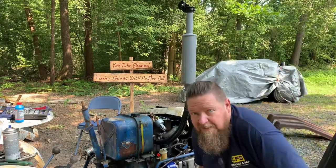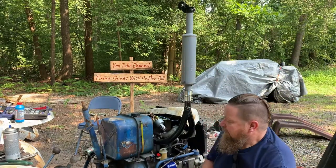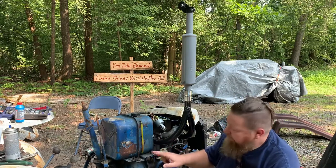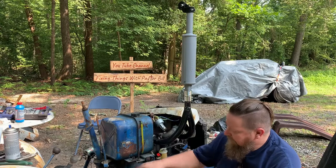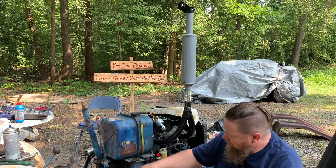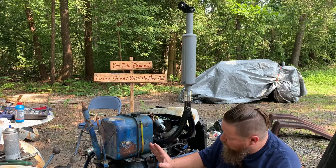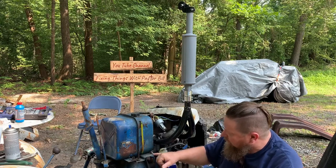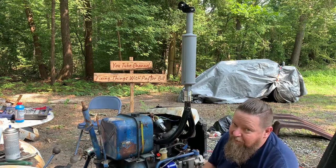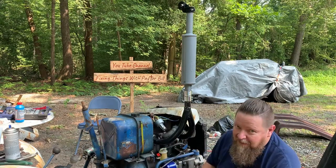All right, miscalculation here. The fuel tank bracket and the battery bracket, which is together, is mounted to the transmission. So we can pull all that part away with it, but I have to disconnect the fuel and maybe more of the electricals. I'll probably take some of the weight off too. My bad, I should have looked.